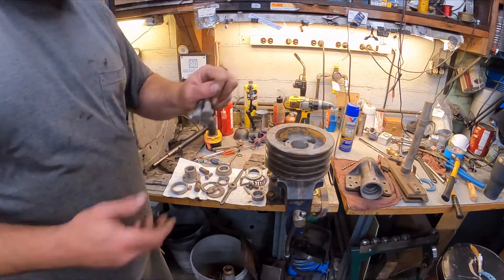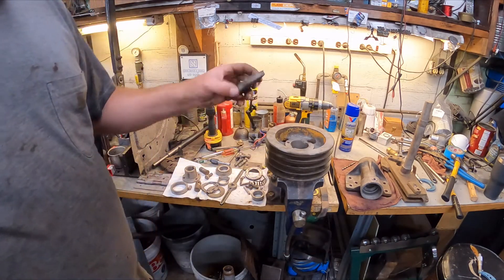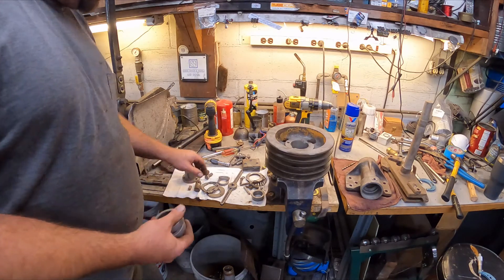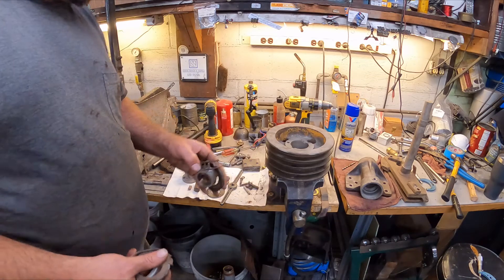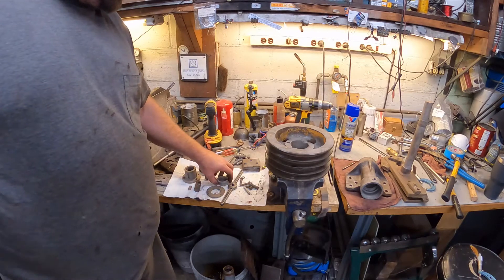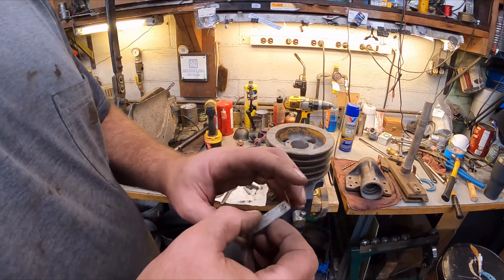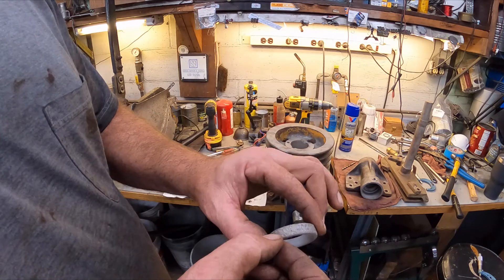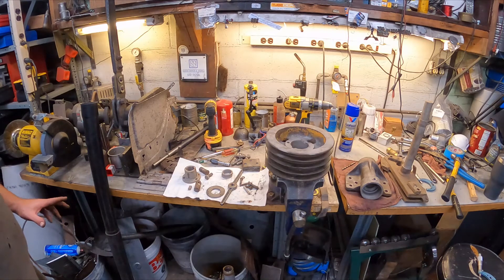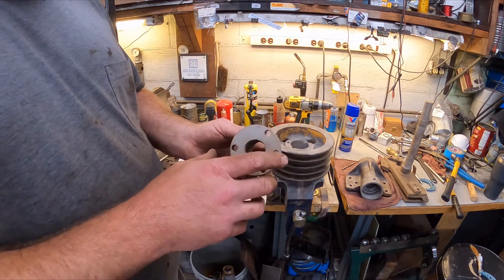Off camera I went ahead and cleaned up all the bolts and chased all the threads on the mounting plates. All the old bearing race stuff is junk now since I've got the parts on order. One issue I did see is these spacers are also used for the seal and they're pitted pretty bad - I haven't decided what to do yet, but I'm actually thinking about making two new ones. I'll also chase the threads in the housing just to make sure they're good.